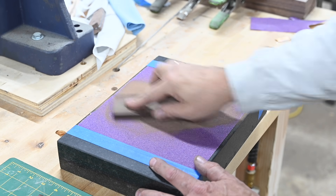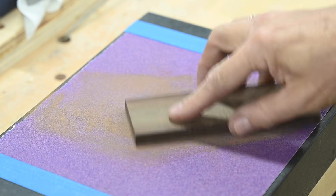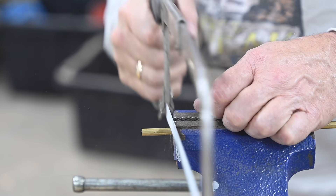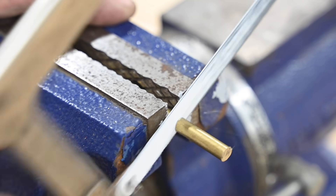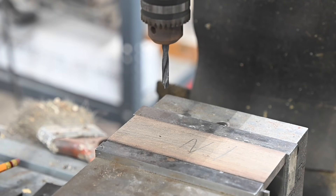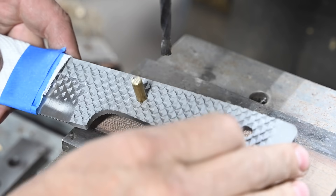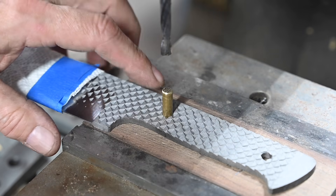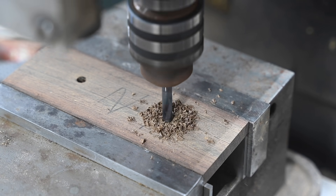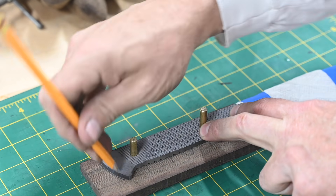Next, I'll flatten them by hand on a sheet of relatively coarse sandpaper. I recommend always labeling which side is the inside — otherwise, if you're like me, you'll forget and drill the holes in the wrong place. I'll be using brass pins to hold the scales on, just hacksaw and elbow grease. The procedure is: drill hole one in your drill press, insert a locator pin, drill hole two, flip, repeat. You can do this with a hand drill, but this is really the sort of application where a drill press shines.